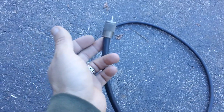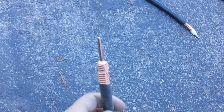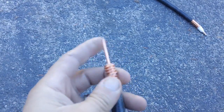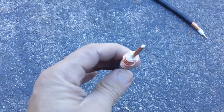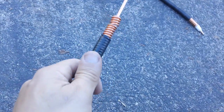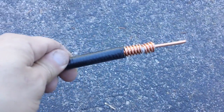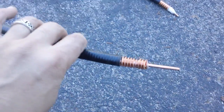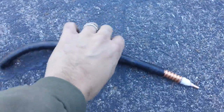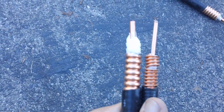Beyond this point is where you get into the commercial grade stuff. If you've got deep pockets or know somebody, you run into this grade here — this is a half-inch super flex. You can see the size of the center conductor; it's a lot bigger and sturdier, and the outside is jacketed by a corrugated copper jacket. It's pretty flexible but you can't really do sharp turns on it. This is what I got running up there a quarter of the way, and mostly I have this half-inch hard line running up there — it's a bit thicker than the super flex with a bigger center conductor.